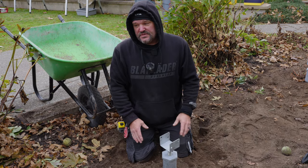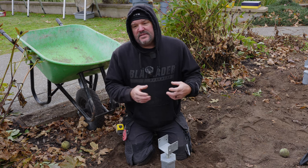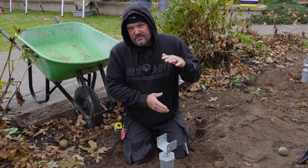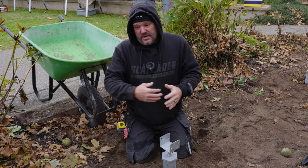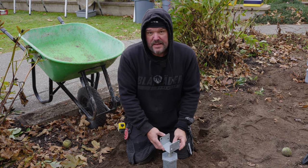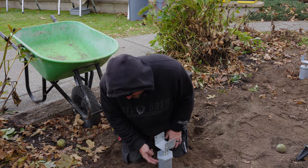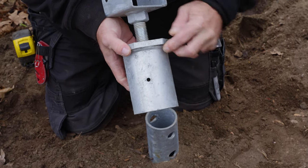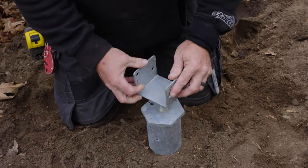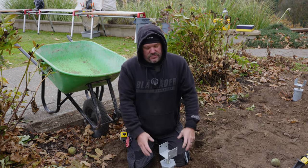That is how we're finding elevation. We've got this thing set pretty much to where we want it, and now I can make micro adjustments after the beams are in because not every beam is exactly nine and a half inches and not every joist is seven and a half inches — some may be thinner. Once everything is set and I'm happy with all the elevations and we're ready to frame, we go back and put set screws. There's a pre-drilled hole right here and we take a set screw and drive it through into the pile and into the steel, which holds things in place with no uplift.